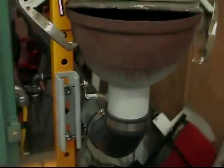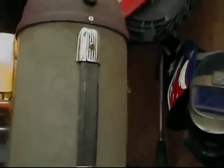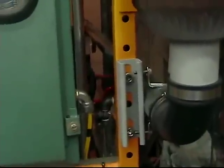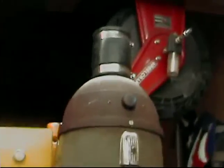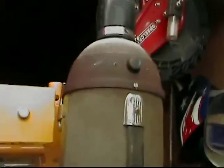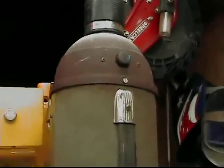Okay, but what I will tell you is what happened, in my opinion, is when this vacuum shut off from the electrical issue that it had, when I pressed that button, that's when it blew. So there was definitely a short in this thing. And when it shut off, this whole pipe that you're looking down the length of right here was in just as much of a vacuum as the rest of the system, all the way back to that check valve. So as soon as this blower shut off, an inrush of air came back through here, through the flare, all the way back into here, and mixed with the gas that was in this pipe. And when I pressed that button, it was like the charcoal grill igniter. That's what blew this thing apart. So I wanted to share that with you.